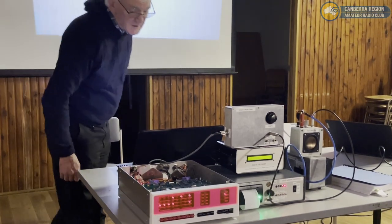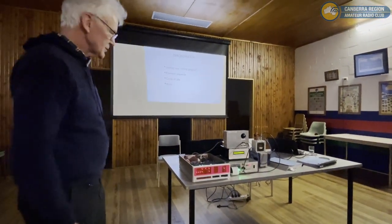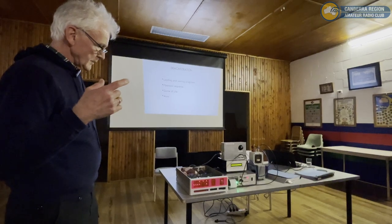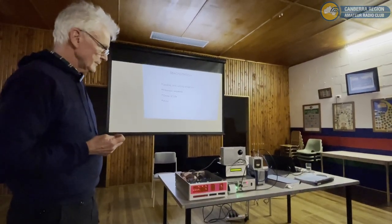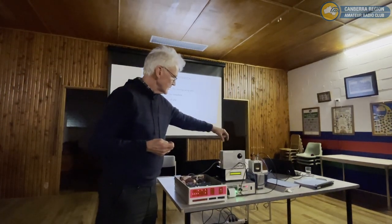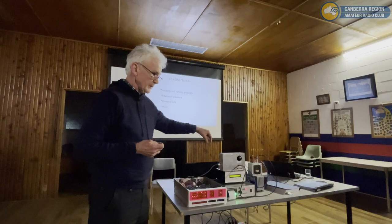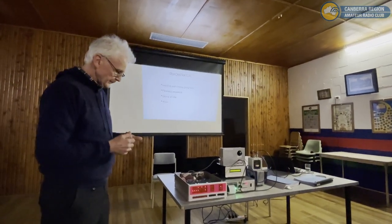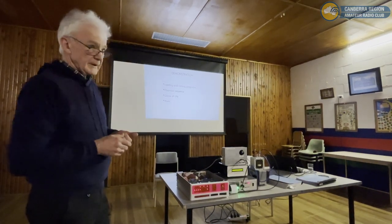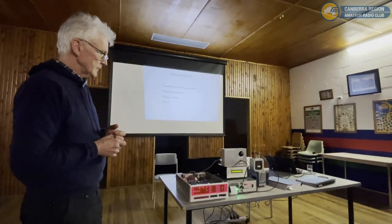So that was 150 bytes of memory, including the chip. The actual instructions to run it are probably 10 instructions to read the memory location, output it to the serial port, and then each one, four bits decide the note, then another two bits decide the octave, and another two bits decide the timing. So you can have four note lengths in any one of the tempered notes within four octaves. It's the same chip that's in old style electronic organs.